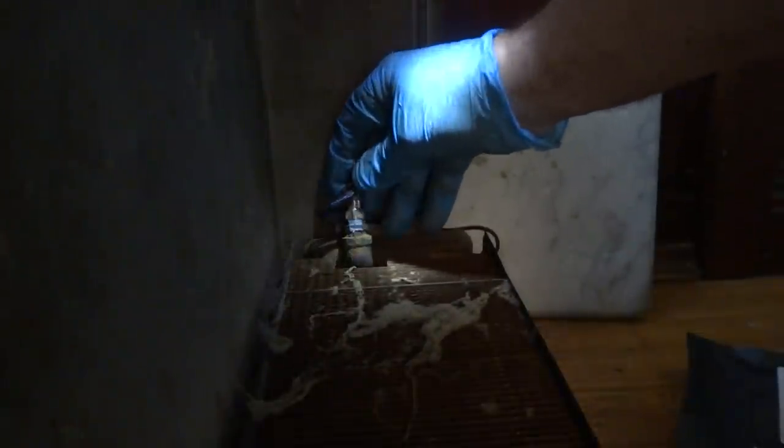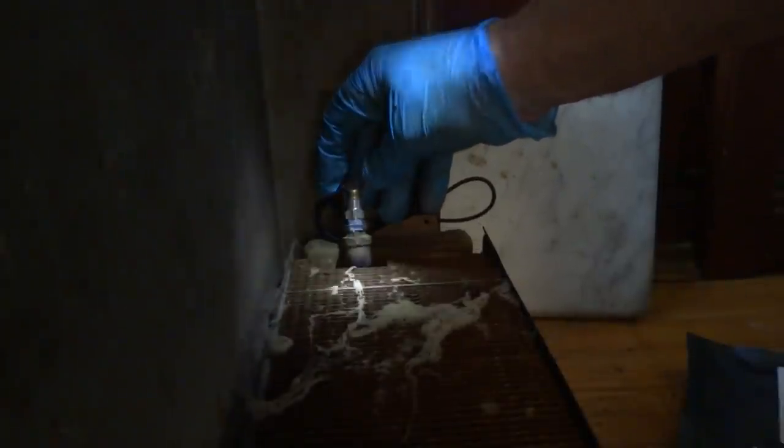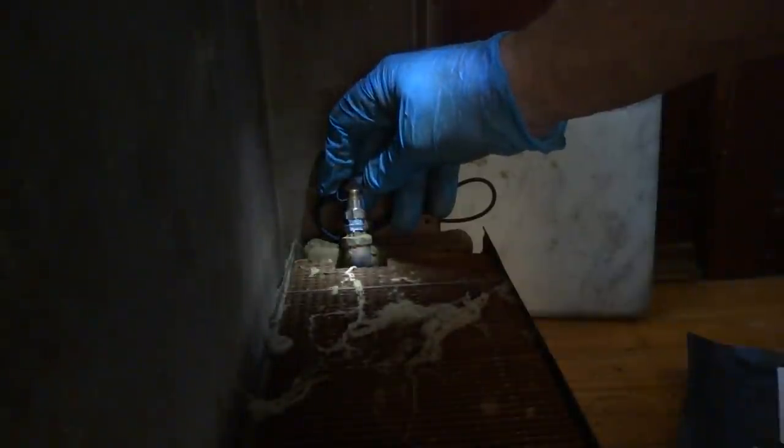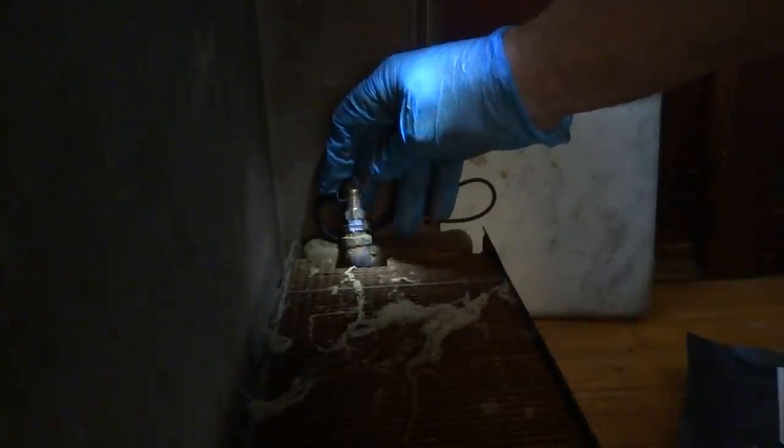This is the one I had to change. I'm gonna leave you a couple of keys here, radiator keys too, to operate this. I don't have to do anything throughout the season. You shouldn't have to. If you ever drain the system down, it's gotta be bled. Anybody that works on it will have the keys. Put them on a string somewhere and you'll have them, okay?